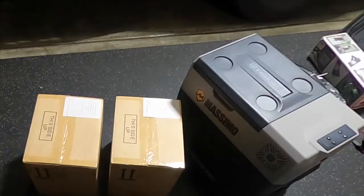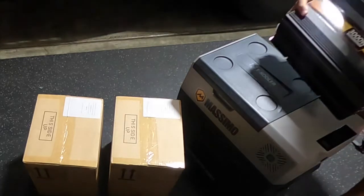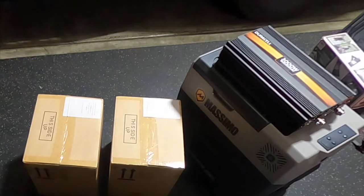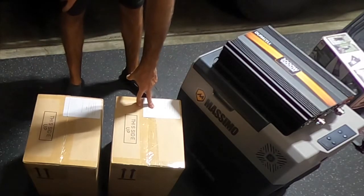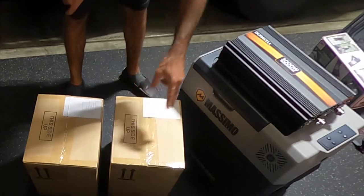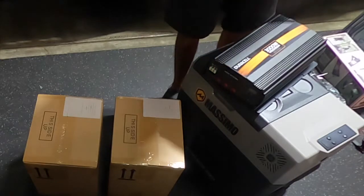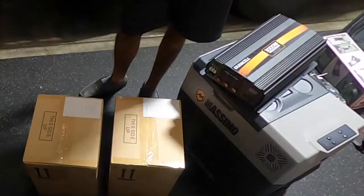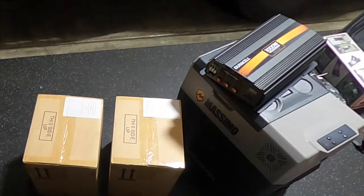I was thinking about my setup with my e-cooler — remember I did a review on that — so that's primarily what I'm going to be using batteries for. Also from my other review, we had the Duracell inverter. The way this is all supposed to work is: the solar panel goes through a charge controller, connects to a battery, charges the battery, then from the battery goes to the inverter. The inverter has three AC outlets and poles for DC connection, so from there I can plug in the cooler, camping lights, phone chargers, speakers, any electric accessories while being off the grid.